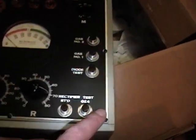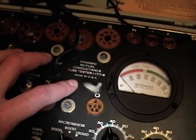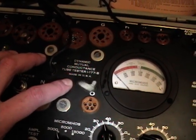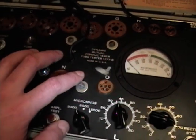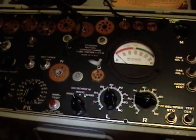The first thing I should do is get a small screwdriver and carefully take out all these screws. I say carefully because they're all in such nice shape — no scratches on the panel, and the screws appear to be anodized or painted black. I really want to open it up because there are a couple of tubes inside: a type 83 mercury rectifier and a 5Y3 rectifier, plus a few capacitors, and I don't want to just plug this in until I make sure those are okay.